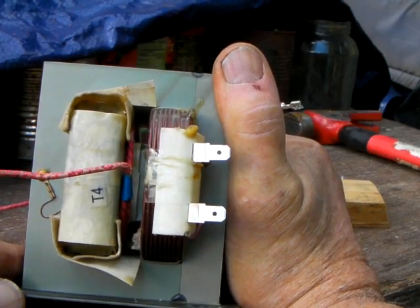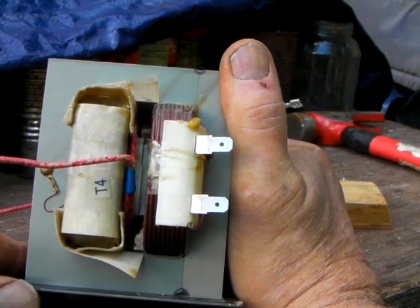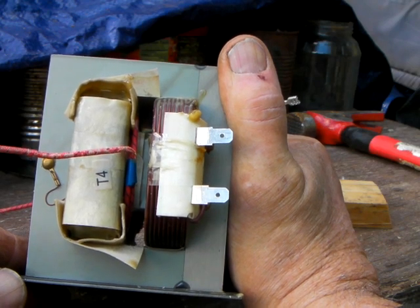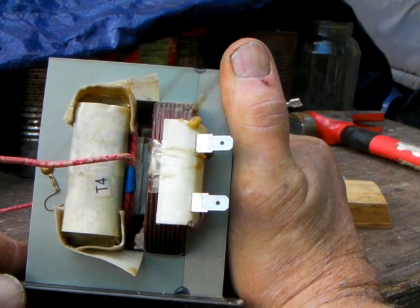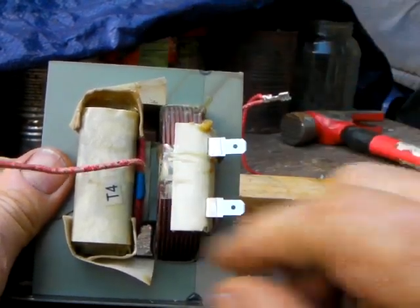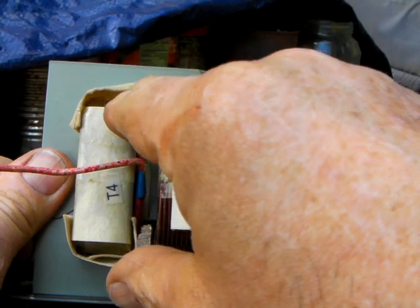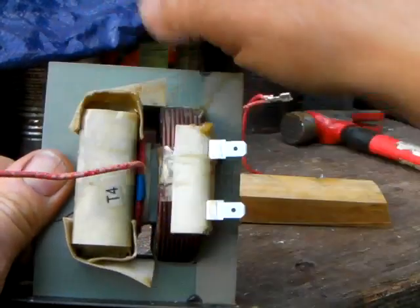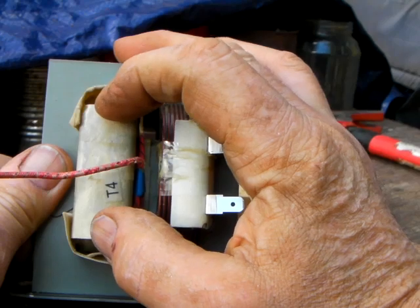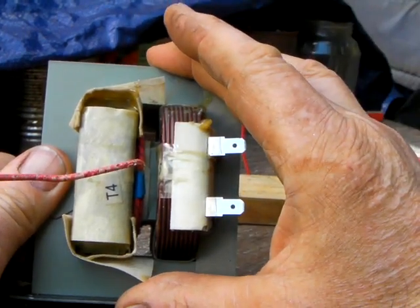One other thing — if you're going to use a tube like a 4CX250 or that family of tubes, you're going to want to do one more thing. This looks destructive but it's pretty easy and simple to do, just a little more work. You'll start by taking a 3/16 or quarter-inch drill bit and just drill down — you're going to tear up some of the laminations, then little by little you pick the wire out and keep unwinding it. Drop at least a quarter inch or more of windings off, and that'll reduce the voltage.